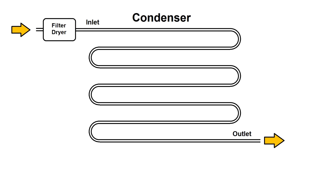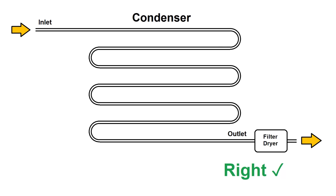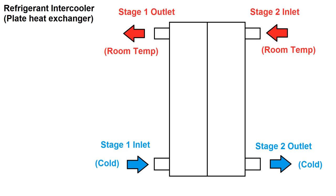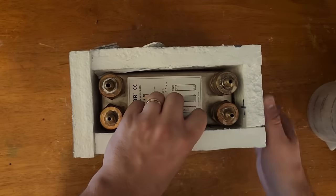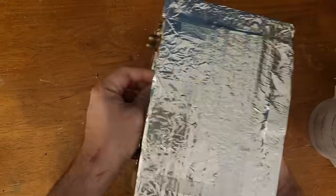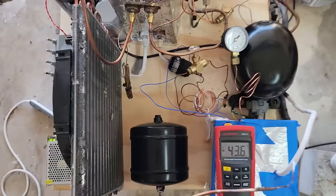I fixed the leak, but then realized I had to rearrange some things. First off, the filter dryer is supposed to be on the liquid side of the condenser, which in the case of the second stage meant putting it on the intercooler outlet. Also, the intercooler is supposed to be vertical — this way liquid refrigerant from the first stage can enter through the bottom and evaporate upward, while gaseous refrigerant from the second stage can enter through the top and the condensed droplets can fall downward. Gravity is your friend in this case. The intercooler also needs to be insulated very well, since it's transferring heat from the second stage to the first stage refrigerant, and any heat transfer to or from the environment would result in losses.